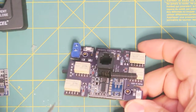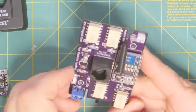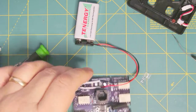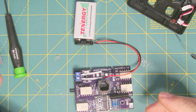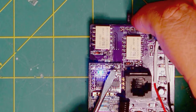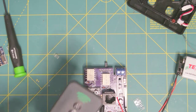I've soldered the receiver board on, and as a last step I've put the antenna on the last pin. Now we want to program the receiver. I've got the device powered by a 9-volt battery just temporarily. There is a programming switch here. Programming is three steps. Number one, we clear everything: hold the button down, then turn power on. You can see the LED blink four times, then turn power off — that clears the mode and clears the buttons.